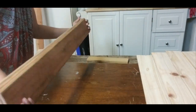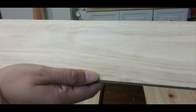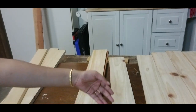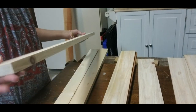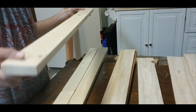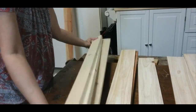I have sanded one side of the plank for a smoother look, and sanded the back side just to remove the sawdust. Since this board is very thin, I recommend you not to sand too much. We also need 3 pieces of common wood for back support. These boards come in 8 feet length and are 3 inches wide and 1 inch thick. Cut the common wood to the desired length depending on the height of the wall hanging.